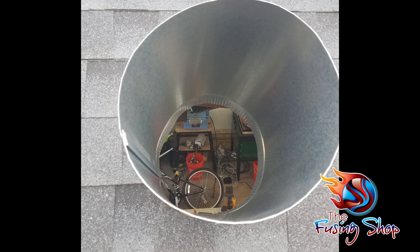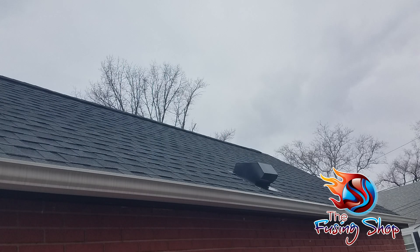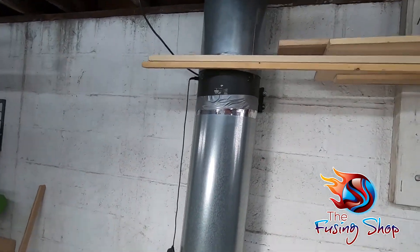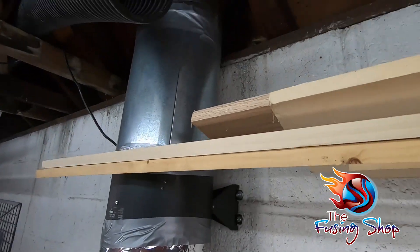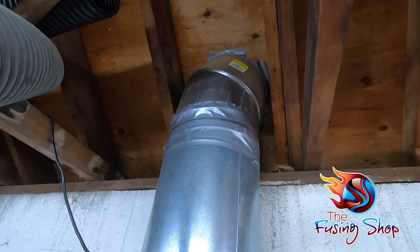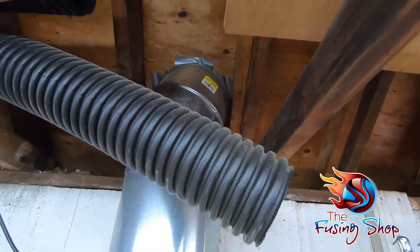Here are a few photos from when I was installing the fan. Here's the hole I cut in the roof, then the vent placement and sizing. This is the cap I put on — it goes underneath the shingles. Here's what the inside looked like before I put the top tube on and bent the 90-degree elbow to meet the cap. I have a 90-degree elbow going up into the tubing, then a flexible 90 connected to the flange on the outside. I used the proper cover, nails, and roofing cement, so everything is waterproof — it is bone dry up there.